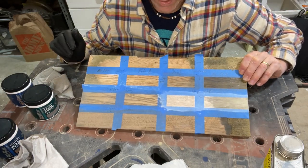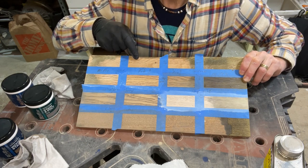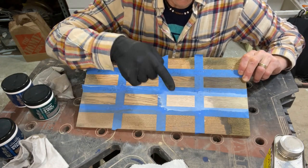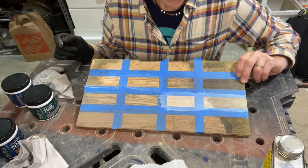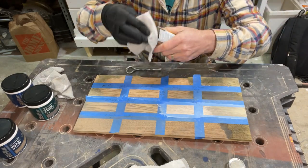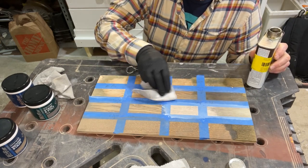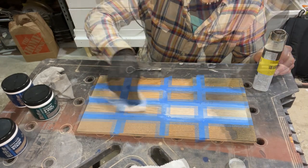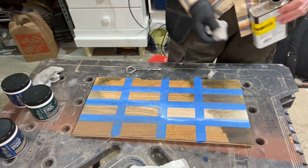The stain has dried and I presented it to my wife to see which one she liked the best. She likes this one and this one the best. This is the water-based pre-stain. This is the oil-based stain, simply white, on pre-stain. This is no pre-stain. So I'm going to put some oil on it right now and see how it changes. I'm using Watco Natural Danish Oil to see what these look like afterwards. I think that one's going to be the winner, but I do see some orange showing through. And this white didn't even show up — washed right off.